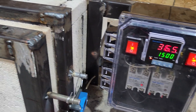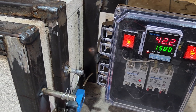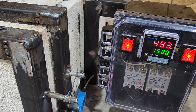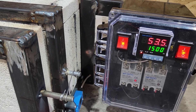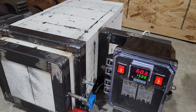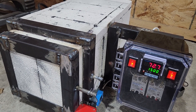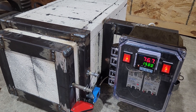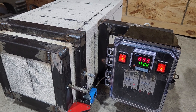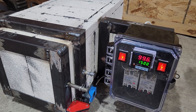I've got a thermocouple in here that's rated for up to a couple thousand degrees, but it's not as accurate or responsive at lower temperatures as it is at higher ones. I don't think I'm going to use this for tempering, because down around 300–400 degrees that thermocouple won't respond as I'd like. So I'm going to use a separate tempering oven with a similar controller setup to hold my tempers within a few degrees — 375, 400, whatever I'm doing.